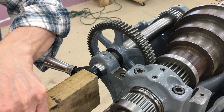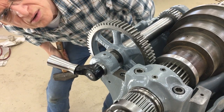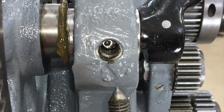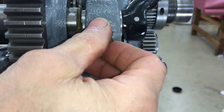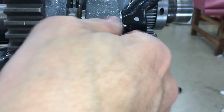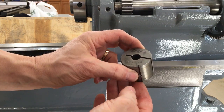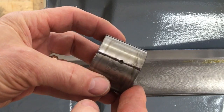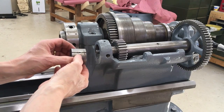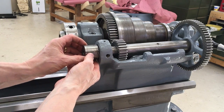There's a small hole in the bushing that you line up. The hole is put in the bushing at the factory and it provides perfect alignment with the set screw so that the back gears are engaged properly with the spindle. The bushing on the other side is the same way, and you can see here the little hole.